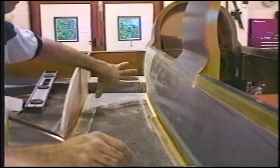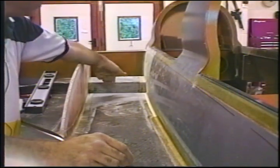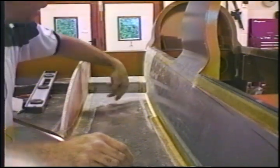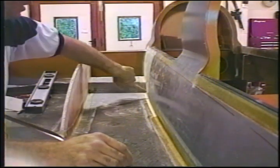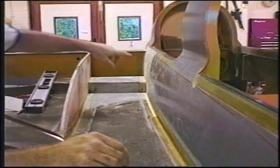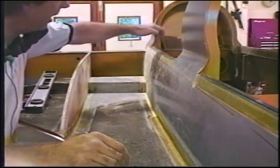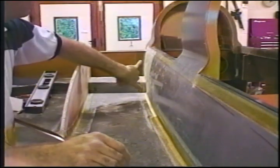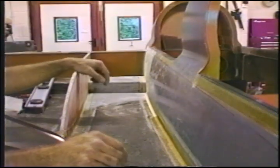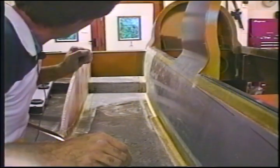This bulkhead will be in place, obviously, and you needn't tape this side of it because you put it in place, tape this side, and then, of course, this is going to be cut out, and I'm going to show you that in a moment. I'm going to cut this area open, and I'll show you how many plies go around this corner, lapping to the inside surface, around to this front face, where your fuel gauge will go. Now that that is perfectly clear, we'll go on to the next section.